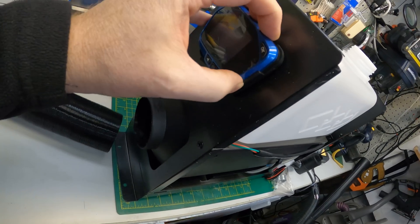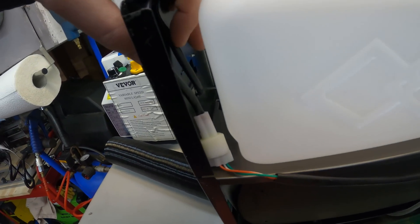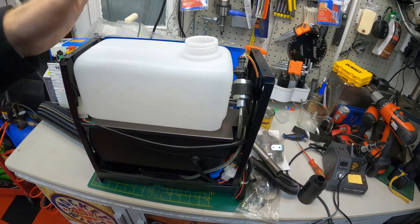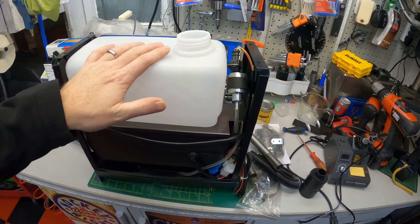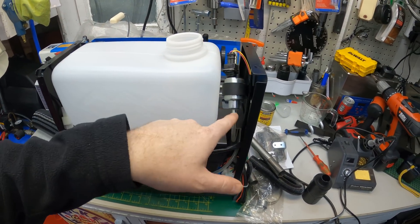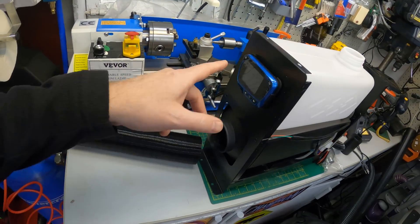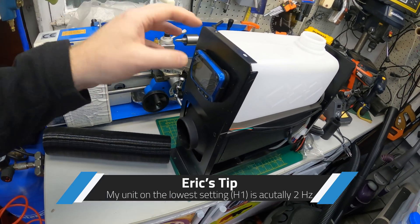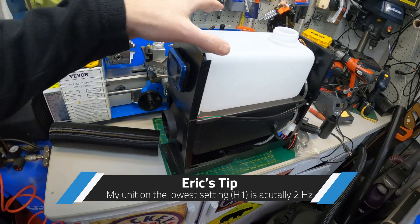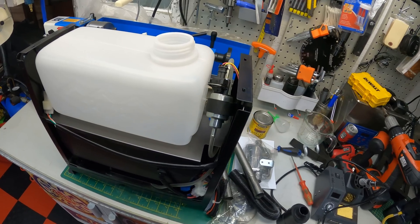Control panel here does come off on this one. Not a lot of cord but just enough — there's a loop there — so I'm going to mount it on the side. On low this will run for in the neighborhood of 72 hours, 34 hours on the next step up. This shot is 0.02 milliliters per piston stroke. This is a PWM unit measured in hertz. The lowest setting is about one hertz, up through around three hertz at roughly 60%, and five and a half hertz at the high. It's easy math — it's a positive displacement pump, always outputting 0.02 milliliters no matter what.